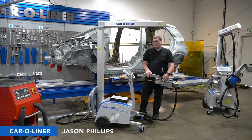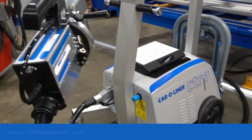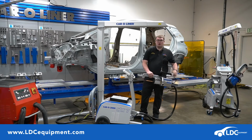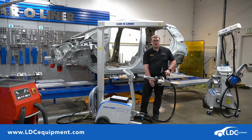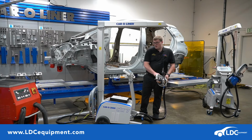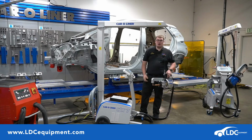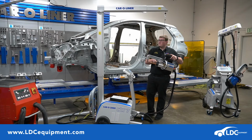So today we're going to talk about the CTR7. The CTR7 is a semi-automated welder with the transformer on top of the gun, so it's called a trans gun. The transformer is on the gun so you get better, more efficient power. It's got lighter cables so you don't have the weight of the cables. The gun itself rotates for better access into the vehicle. The boom has a built-in tensioner in it to take the strain off of your body. The boom also raises so you have better access into the vehicle.